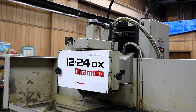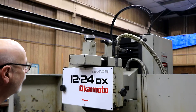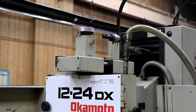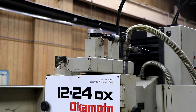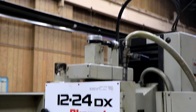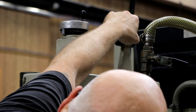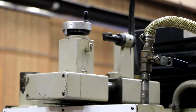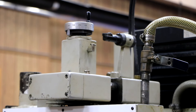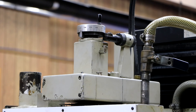I'm going to show you the dresser up here. Down here is your control — bring it out. There's a knob in the center down here to slow down that speed or increase it. Then you go back, and when you go back, it automatically advances for the diamond for the next dress. So we come out; it's adjustable up here, and it's got these knurled knobs that you have to adjust. When it goes back in, it'll advance the diamond, and you can set that to be one, two, or three — you have to see what it actually does. That works pretty nice.